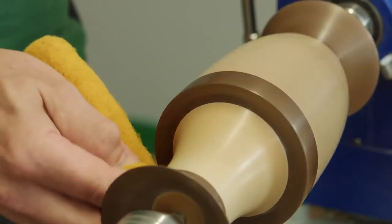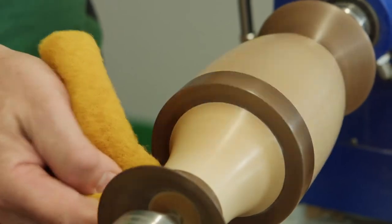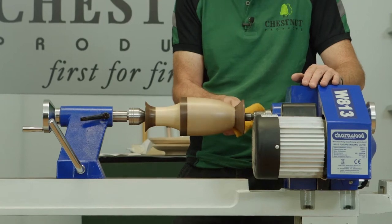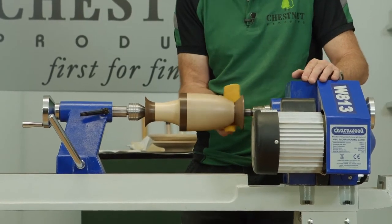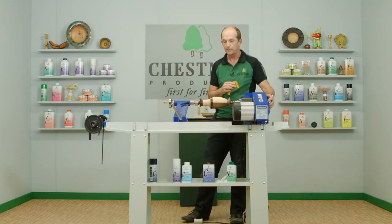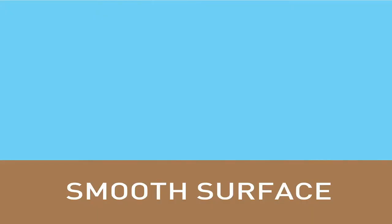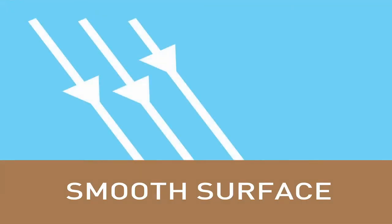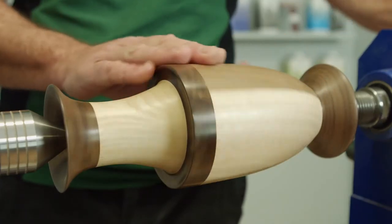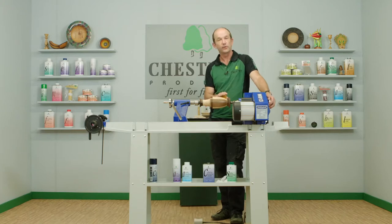No real pressure required here — the lathe's doing the work for you. It's a sanding sealer; it's designed to be sanded and sands very easily. There we go — that's now smoothed down and ready to go. If we remember that the eye sees gloss by the amount of light reflected, the fact that we've put the sanding sealer on and smoothed that down so well means we can see a sheen starting to grow on there.